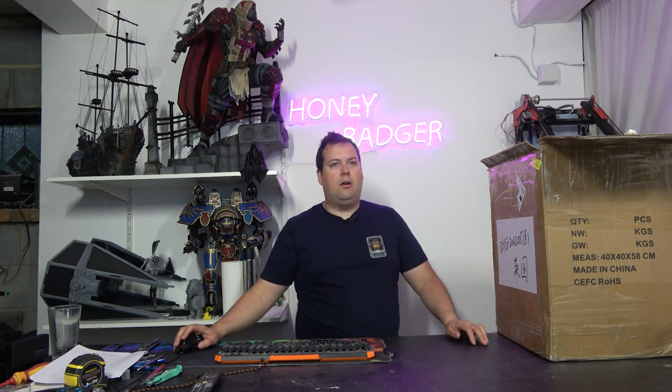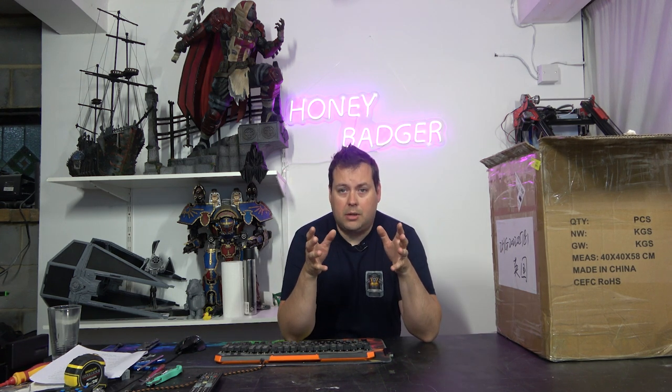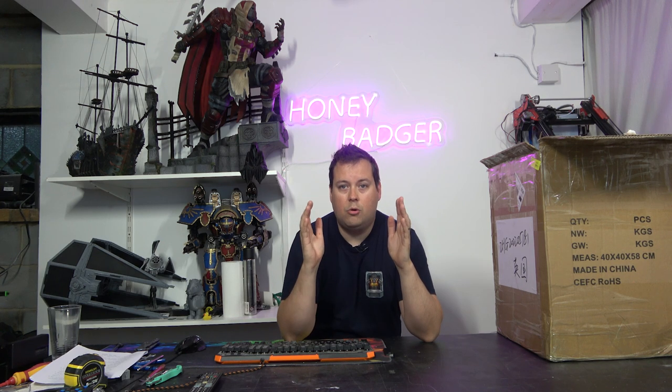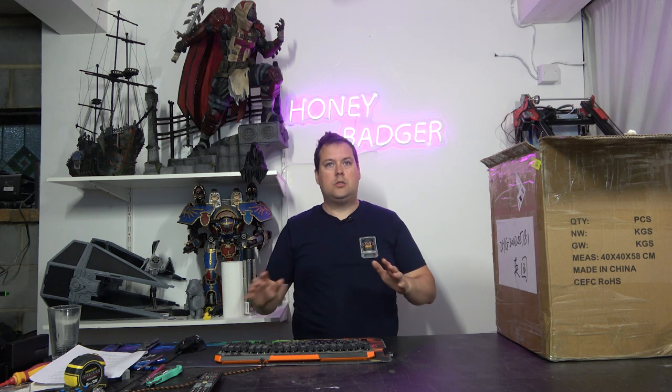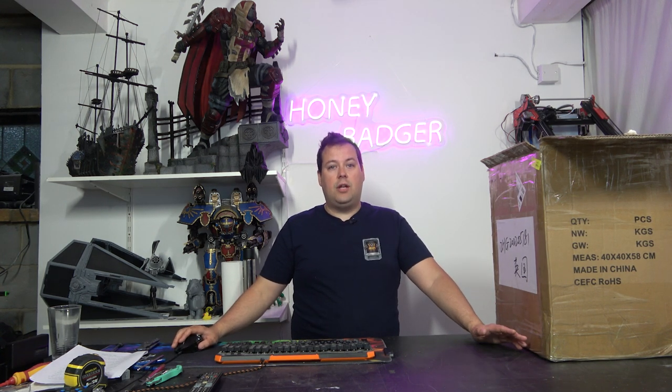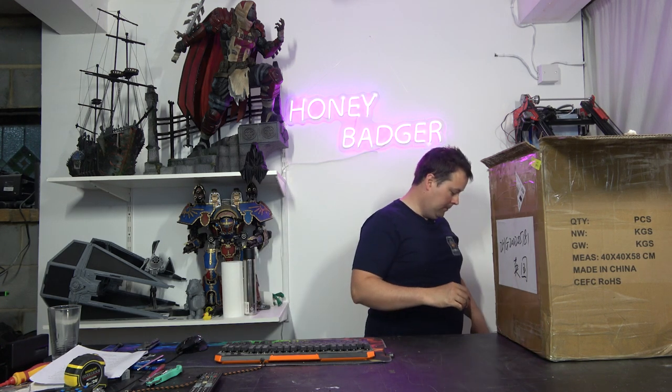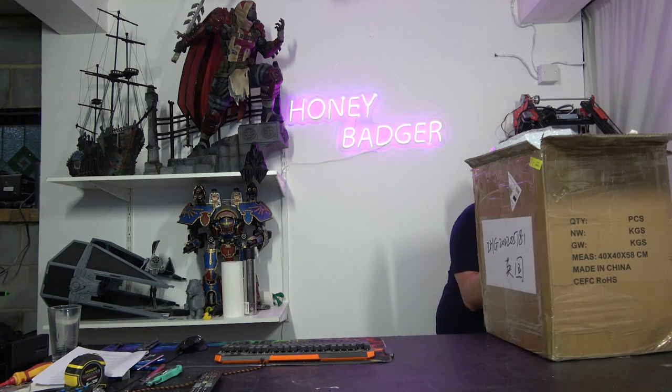What this boasts about on the website is uniform production — a weight deviation of less than 2%. So if you're thinking about dental molds and printing for dentistry, the absolute key is accuracy and consistency. Any deviation in the warping or moving of parts is a huge problem, so a uniform deviation of less than 2% is actually pretty good. The constant temperature created by warming the vat is between 25 and 30 degrees, which is perfect for resin temperatures. It claims a 35 micron accuracy, which is fairly standard for a 4K machine of this size.